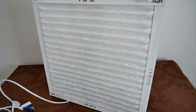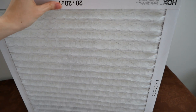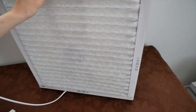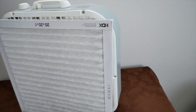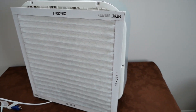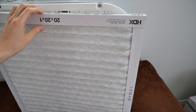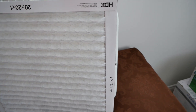This also has an added benefit: the suction of the air will just suck the filter up against the back of the fan, which is great, because then I don't have to use tape or screws or anything like that. This fan is not going to be a dedicated air filter fan — I'm going to sometimes use it just as a fan, so I want a way to be able to remove the filter without peeling tape off or undoing screws.